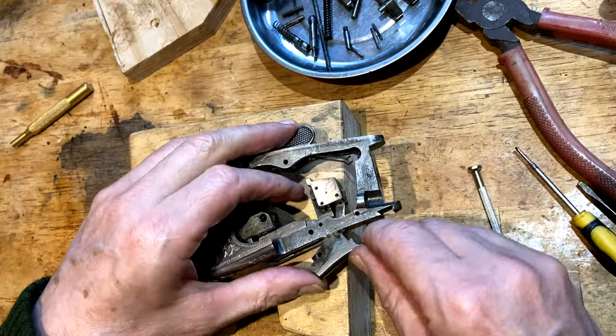A little roll pin. So you need to feel the roll pin. There it is. There's a taper, so you've got to find the taper. It's never always the most straightforward thing to do. And try not to block your view, as per usual. Trusty thin Allen key, just to hold that in place briefly.